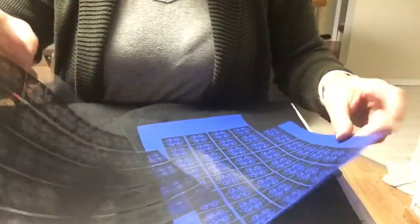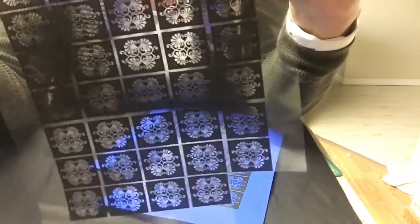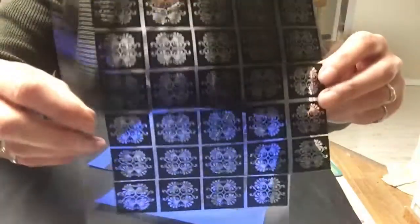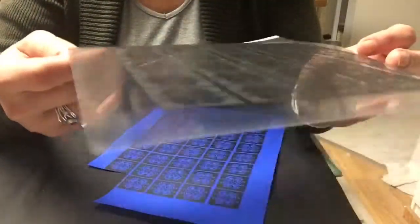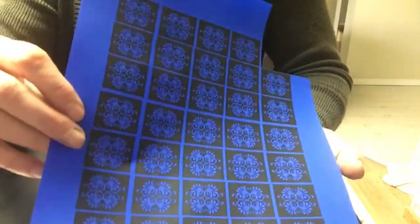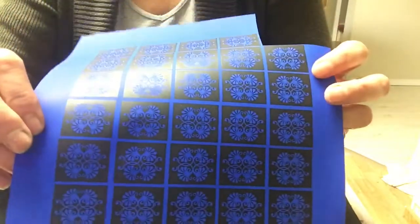The next two options — it's really a toss-up between these two. This is laser transparency paper; you print on the pebbly side. You'll be able to feel which side is the print side because it feels pebbly, and the other side feels very smooth. You can see it's glossy and shiny on the non-print side and has a matte finish on the printing side. Then this is what is actually designed and meant for etching: blue press and peel — glossy on one side, don't print on that, and matte on the other, which is the side you print on.